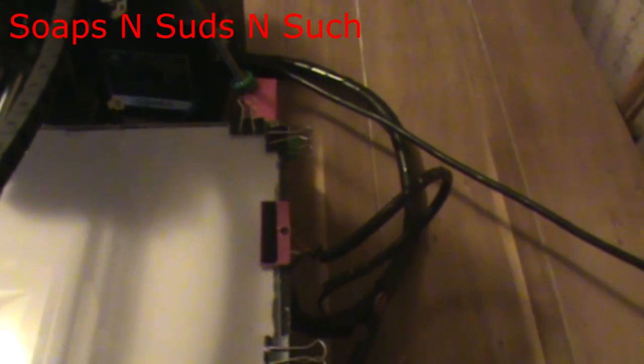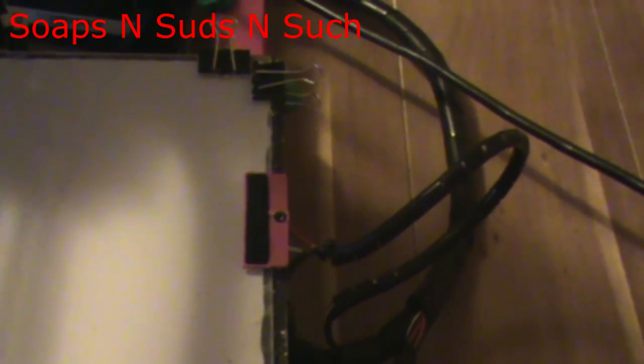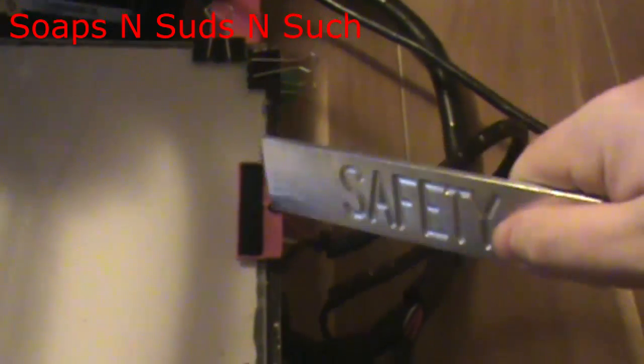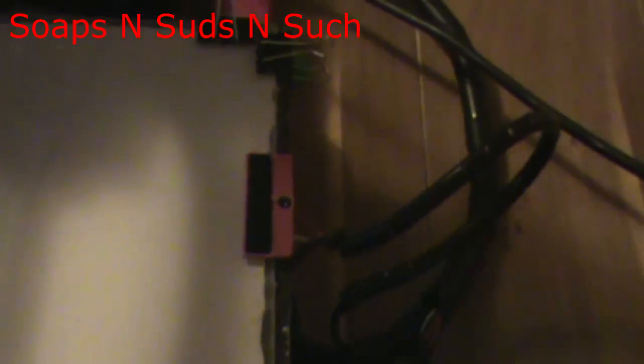Alright, now we are back, and as you can see, this is the actual wiper. It's really small. I tried to make it non-intrusive because it's taking up bed space, so you're not going to be able to print to your full extent with a wiper — that's why I tried to make it smaller. Now, the bed's heated up so I don't want to touch it. However, as you can see, I've got a screw here that runs through the actual heating plate, and that is what's crucial — these heating plates have a hole in the back of them. Even if it's covered in the stock build-tak-like material, there should be a hole back here if you're using a Wanhao or a Maker Select. You just need to check and make sure that there's a hole here on the back of your heated bed plate.